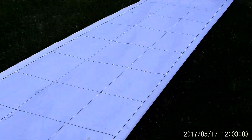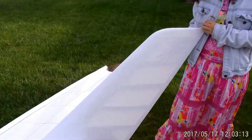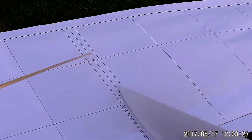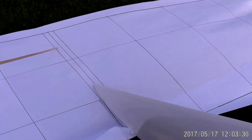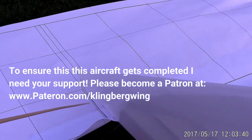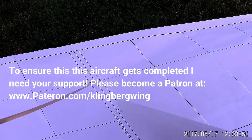Now as we come back out here to the winglet — this is the auto-yaw winglet. Go ahead and pivot that outboard, just twist it a little bit. So when it corrects for yaw it's going to swing outboard like that, and when it comes back inboard it stops in the neutral position, which is straight back from the wing. You see here the lines showing a two inch wide section of the wing that will be the rigid winglet mount. This is another wing joint here. So we're going to have 11 feet of panel there with the elevon on it as a separate panel, and then there's the winglet mount. The winglet will be attached to this. If you watch my other videos you'll see how that winglet mount is going to be built. This will provide access underneath for insertion of the pins that will join up the outer wing panel.